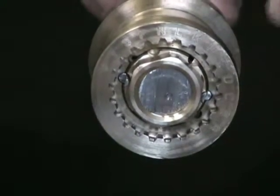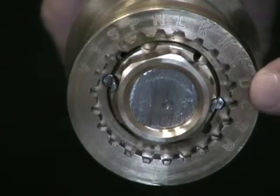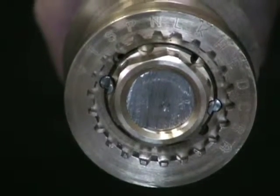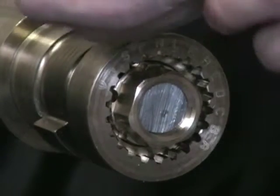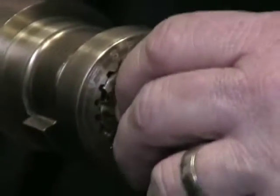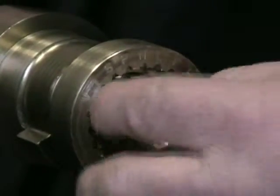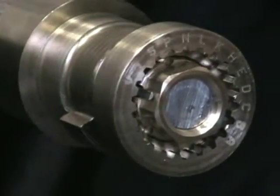When the pins are in place, the flat section of the pin is facing out and the full barrel is below the shelf. That allows the cone gear to seat fully. When the pins are inserted, this flat needs to be below the shelf that it goes into — it needs to be fully inserted so as not to bind up the flat surface of the cone gear.